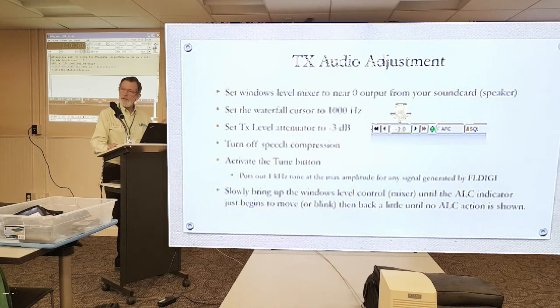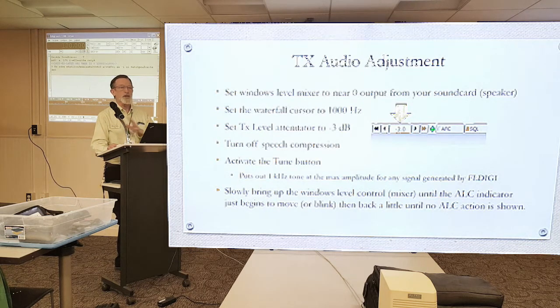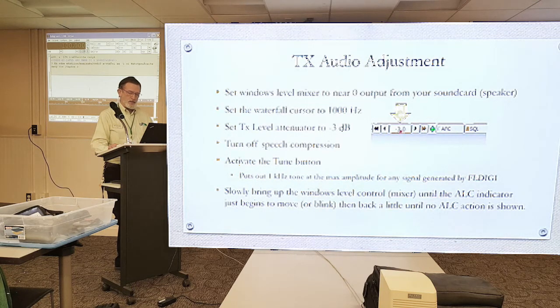If your sideband filter is mechanical or crystal, you may want to do this at 2 or 3 places across the audio band, because those filters are notoriously nonlinear. There's a lot of variations. You can use this attenuator here to make small adjustments in your output power.